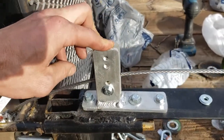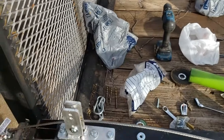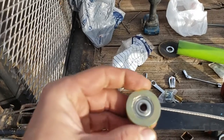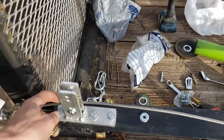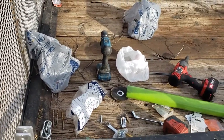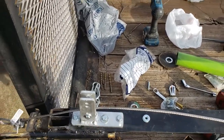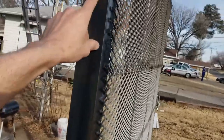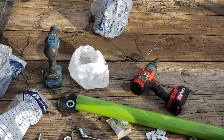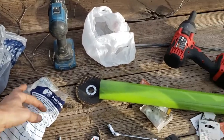You ask what is this little contraption? Great question. You can pretty much make this yourself if you've got a welder — it's kind of like an offset T-bracket. Drill some holes, get some rollers — you can get these for probably 10 to 15 bucks. Make sure they fit your bolt size; I think these are 5/16ths. Install that, lock them down with lock nuts, run it up and hook them right here with an eye bolt.